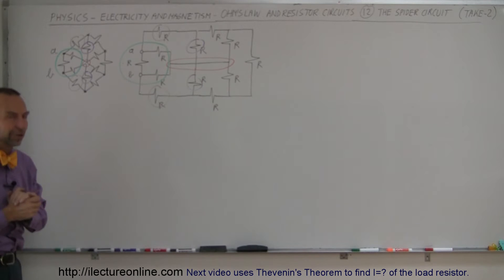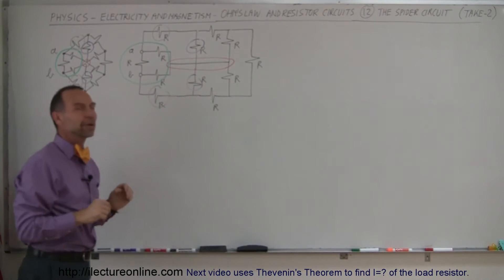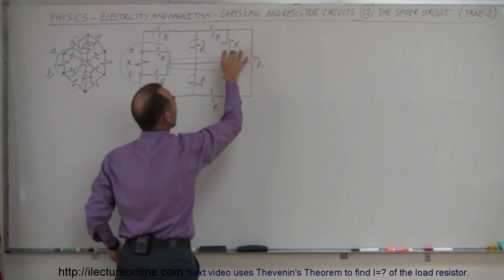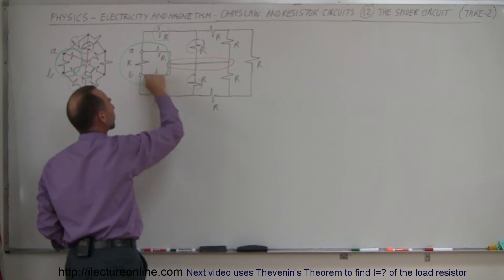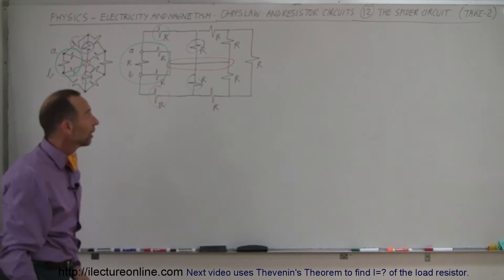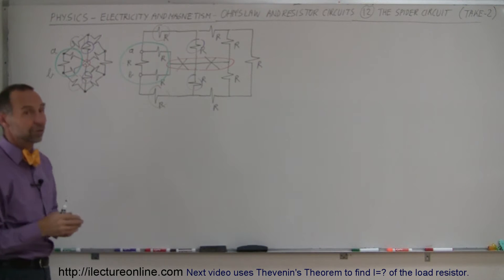As you can see, it's the exact same circuit. What's nice about this circuit is that if you look at it, you can see there's total symmetry between the top half of the circuit and the bottom half. Because of this total symmetry, whatever current goes to this branch must be exactly the same as the current going to that branch, and whatever current goes to this resistor must be exactly the same as the current going to that resistor. There's no reason for any current to go back and forth on this particular branch, so we can actually eliminate that branch — simply say there's no current flowing through here and eliminate those two connections.